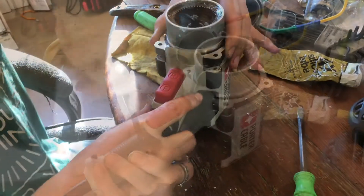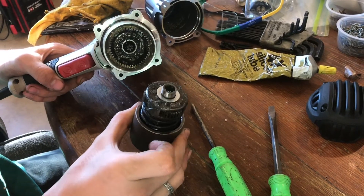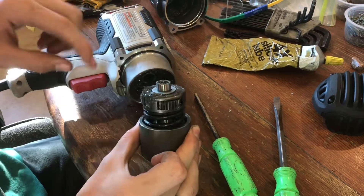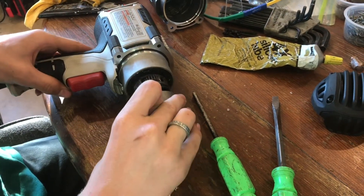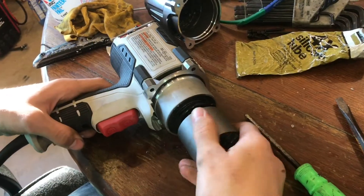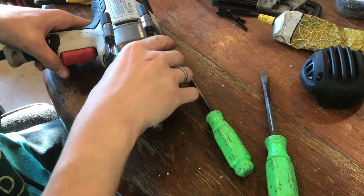Front piece. Now for the anvil and the planetary gear assembly — it slides in place, and I would recommend doing it sideways because these pins in the washer can fall out pretty easily. This is what it's supposed to do — it was completely seized before. And now for the headpiece right here.